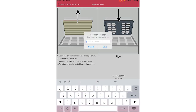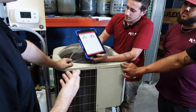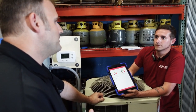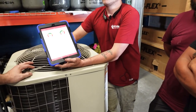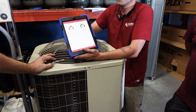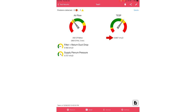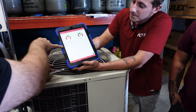Click continue to save it internally to your phone or tablet. There's the diagnostic screen. We can see airflow is in the yellow. Think of this as training wheels — you've installed a new system, your duct work may be okay, and this might guide you to say, 'I need to increase fan speed.' If somebody didn't do a good job on the manual J or duct design, you could have high supply static every install. We can see it broken down: supply plenum pressure is 0.7 — that's aggressive.